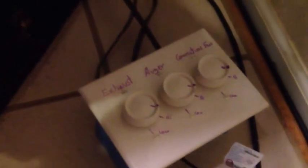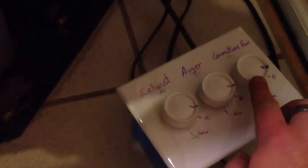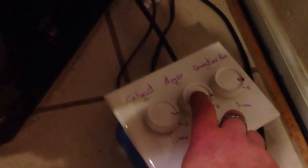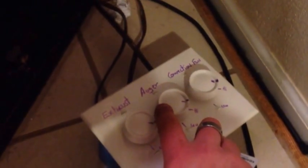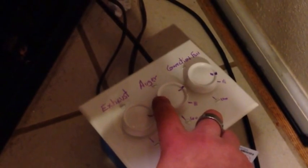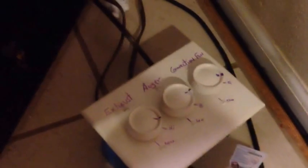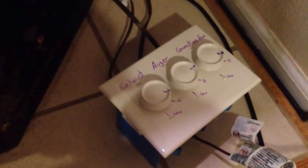Our system is live and ready to go. We have our control module here with wires going out to the different motors on the stove. It's plugged in and ready. The exhaust fan and convection fan are used to being run on speed controls. The auger motor, however, is normally run on a timer — turning on and off repeatedly — so when I turn it on here it's just going to run constantly. Auger motors aren't designed for speed controls, so I can slow it down a little, but the stove will always run at medium to high heat.